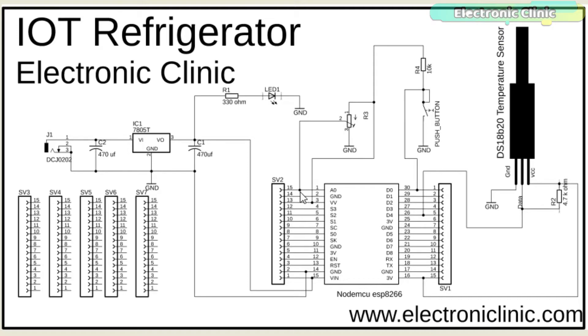The middle leg of the potentiometer or variable resistor is connected with analog pin A0 of the NodeMCU ESP8266 Wi-Fi module, while the other two wires are connected with the 3.3-volt and ground pins. A push button is connected in series with a 10K pull-up resistor. A wire from the junction of the 10K resistor and push button is connected with digital pin D0 of the NodeMCU ESP8266 module. While the switch is open — meaning the door is open — 3.3 volts is given as input to pin D0. When the switch is closed — meaning the door is closed — ground is connected to the D0 pin. That's all about the circuit diagram.